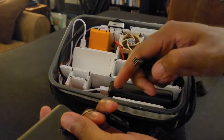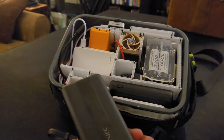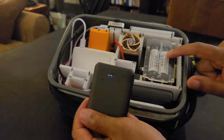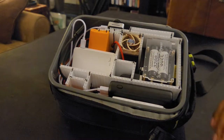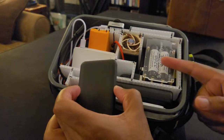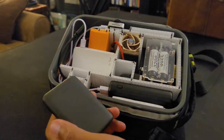You can double-press to turn it off. On the lanyard there's a nice USB-C to USB-C cable that comes with it, so you can always have one handy. I can also charge this while discharging or charging other things. In the previous build I had a different power bank connected to the Raspberry Pi 4, and that's where the problems lay — that one only put out maybe 1.5 to 1.8 amps, and the Raspberry Pi 4 definitely needs at least two amps.